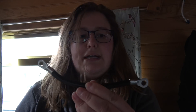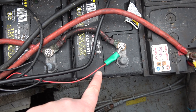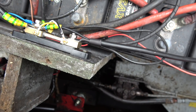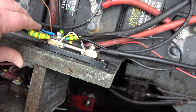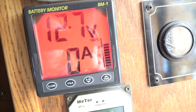I'm in the final stages of fitting the battery monitor. One thing to note is that it comes with a very short connector that goes from the shunt to your battery bank, so I've had to go out and buy one that's double the length because the piece of wood I can attach the shunt to is on the opposite side of the batteries. Here's the red positive out to the monitor through the cable — everything else is connected into the shunt, which I've attached to the side, with my cable going into the negative and everything else that was attached to the negative now attached to this side of the shunt.